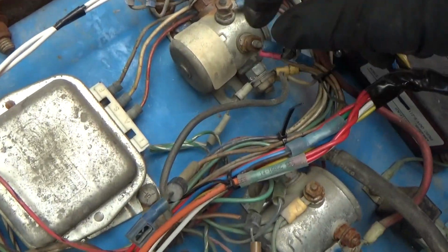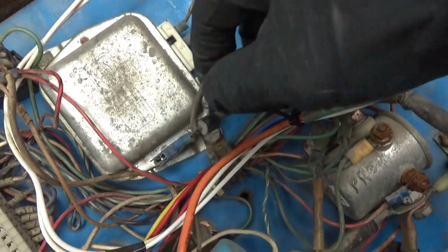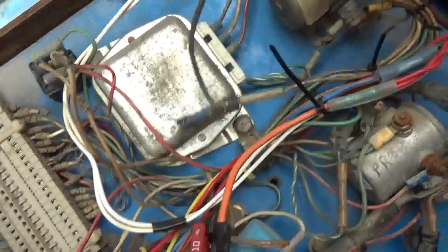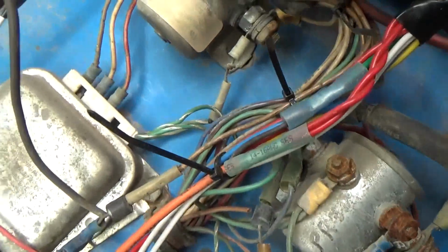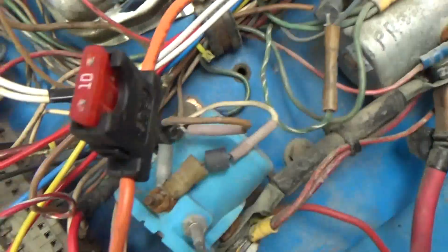Well, Vladimir here did the old school tug test because we're worried about the control feed to this PR1 relay, and doing a little visual inspection. What is this supposed to be connected to? There's a diode here, and apparently there used to be some kind of relay on this side, and then this wire is tied in, and that goes nowhere as well. So that's one of the feeds. There's actually three wires that come into here. I guess we can kind of trace them, but not really.